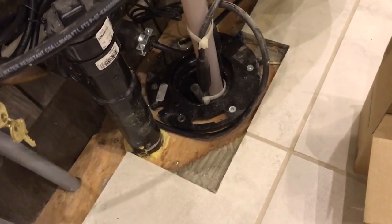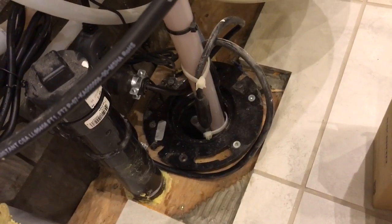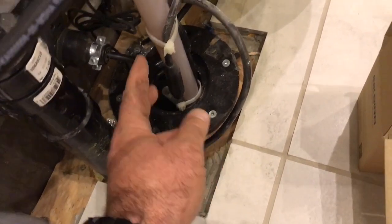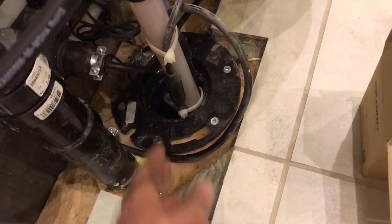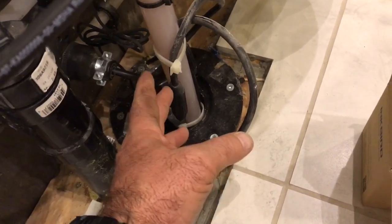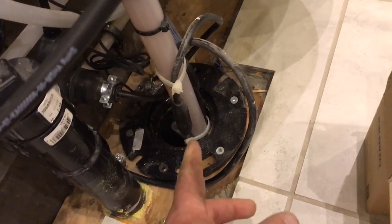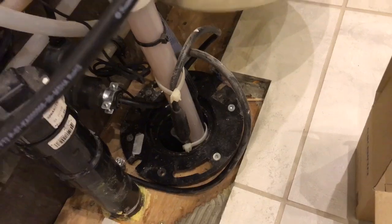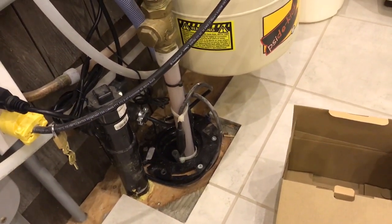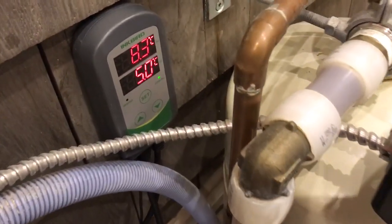Now that's not enough of an arrangement to keep this water line from freezing. So when we installed the water line, we ran two of these heating cables. We really only need one at a time, but you're not going to know if it's broken until it's February and your water line freezes up. So we installed two at once. The heating cable doesn't have to run nearly as often as you think, and that's what this device here is for.